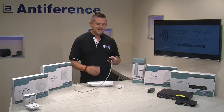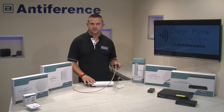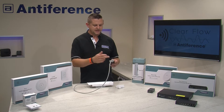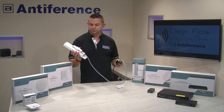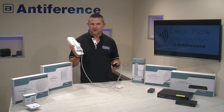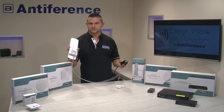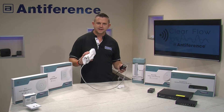It's important to note at this point that I haven't connected it to the network yet, because all these devices are DHCP — meaning they're prepared to accept an IP address from the host network. If I connect this to the network, it will automatically be given an IP address which will more than likely be different to the default IP address, making it difficult to find. So it's important to program it standalone and connect to the network later.